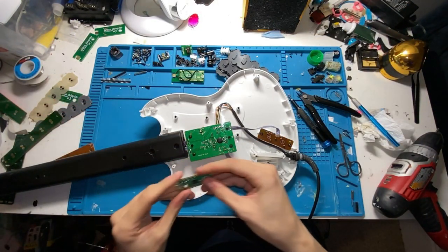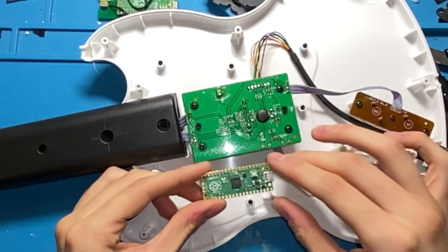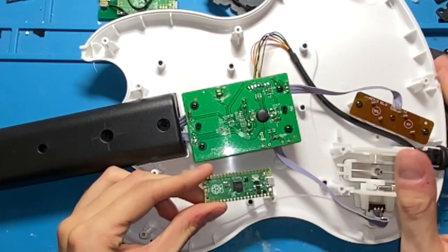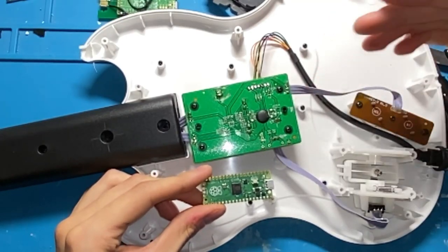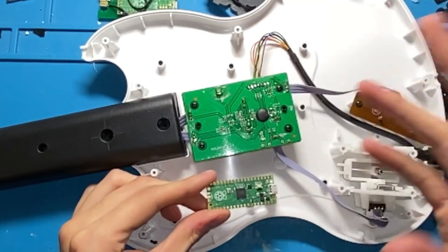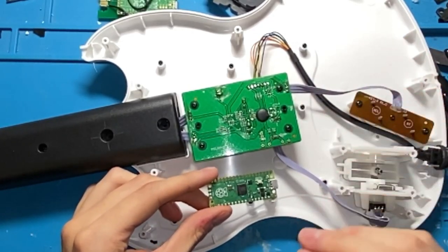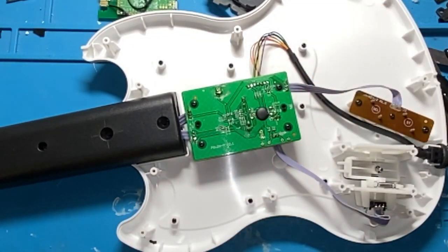So now we need to plan our method of attack. We need to plan where exactly the Pi Pico is gonna go to ensure that we have exactly enough wire to route everything. If you don't, you'll need to rip out the entire wire strip and cut some wires yourself and tin them yourself. It's kind of annoying, so plan carefully so you have to do that as little as possible. I recommend keeping everything screwed down as you do this and just working on the guitar directly.